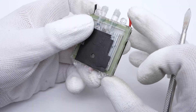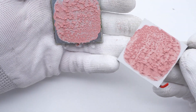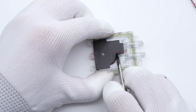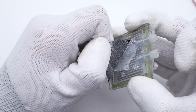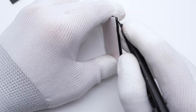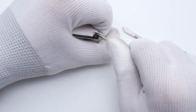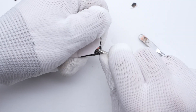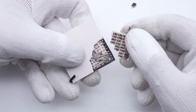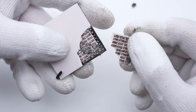Separate the TEC cold plate and water cooling block — they are also covered with pink thermal paste. There is an aluminum plate inside the water cooling block. Taking apart the cold plate, we can see many small square blocks inside, called PN junctions. It can cool on one side and heat on the other side, conducting heat from your phone to the water cooling block.